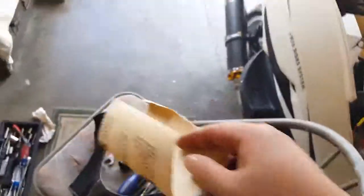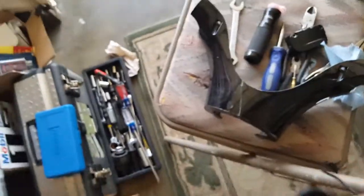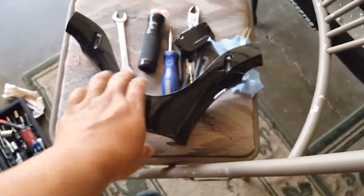We'll take a little bit more grit sandpaper here. It looks like it can do a little bit harsher. We could do 150 on it, and then we'll work on our 600 maybe toward the end of it. So all we need is a little piece, not even that much. See, right there. Just keep working a little bit. We could wet it a little bit, but I think we'll be okay.